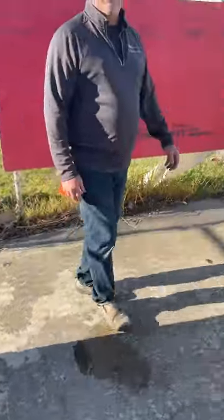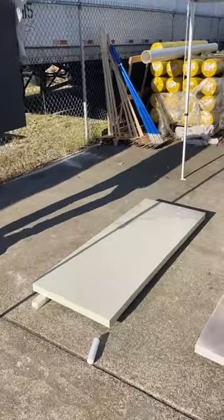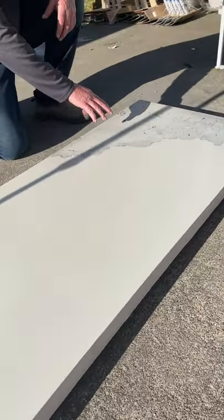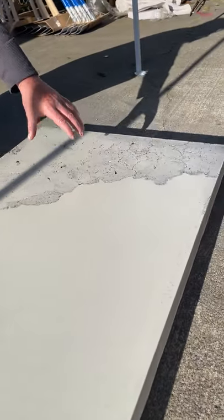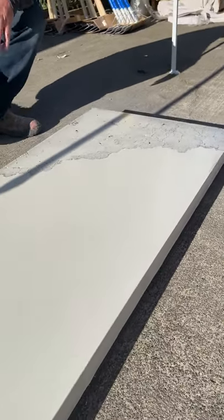We've got a few more of these little countertops that we're doing some real trick stuff on. Same thing here — we've got some XS precast and we do a press technique where we precast these upside down and put some little balls in to create rock pockets, so when we flip it over we can skim coat with another color to create more of a granite-type natural look.